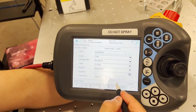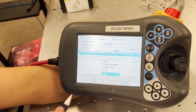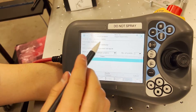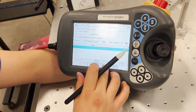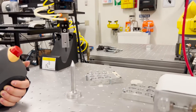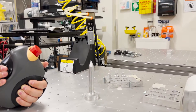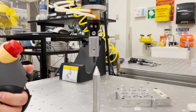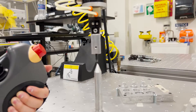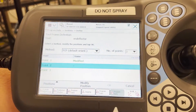You can leave the settings as normal and default, then come over here, make sure it's highlighted, go to edit and define. Being that we are using the three-point method we will change this to three. As you go to your first point you now set it ready to modify. Returning to the jogging menu, you come over here. Around there is pretty close, so then we can go back to the program data and modify the position.